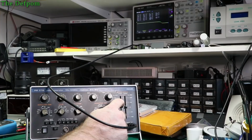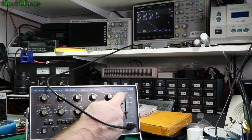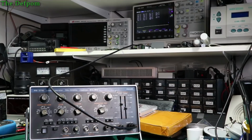And if I center this like this, it is shifting up and down, but there's no positive pulses. The negative is changing by a lot, right? Because you set them individually. I think it's like a maximum of 10 volts between them or something. So there's no positive waveform on that side. It's a bit strange because the most it will go up to is zero. It won't go even slightly below zero. I know it will go higher, but yeah, okay. Maybe I'm talking rubbish. But yeah, it's just being a bit weird.